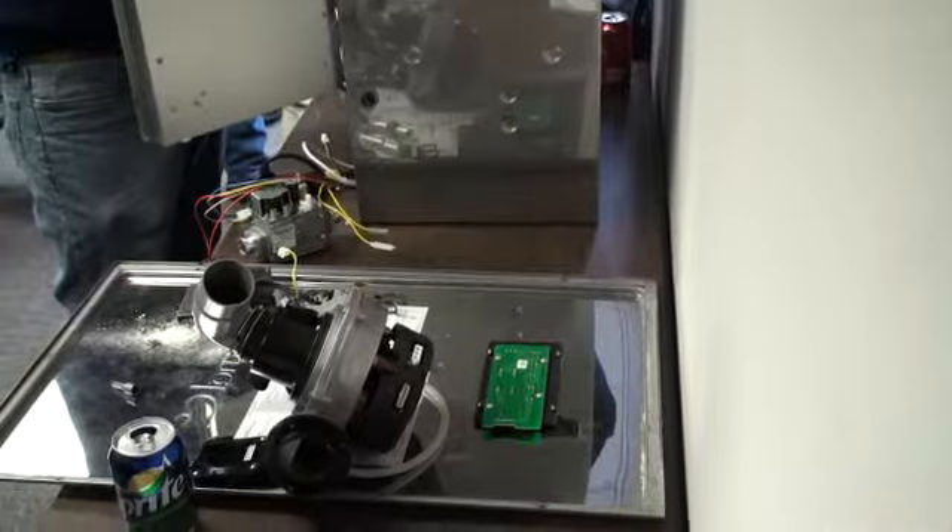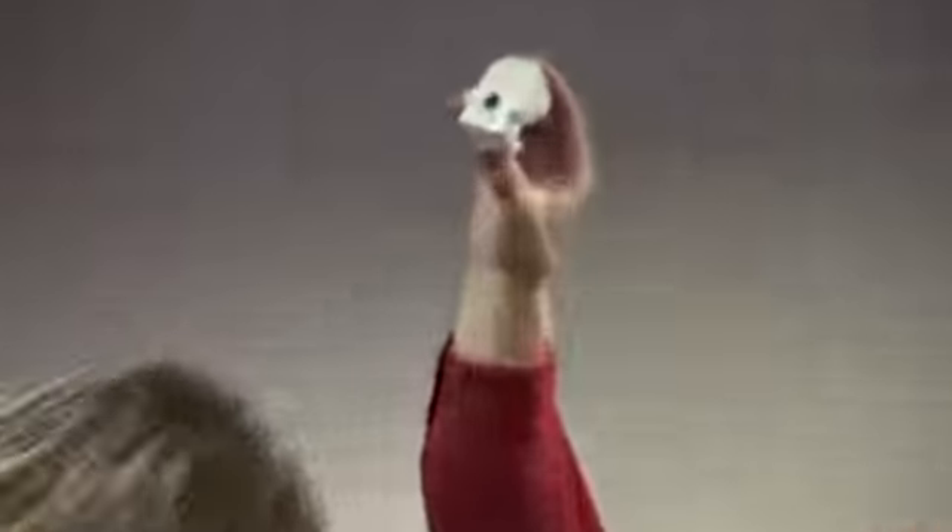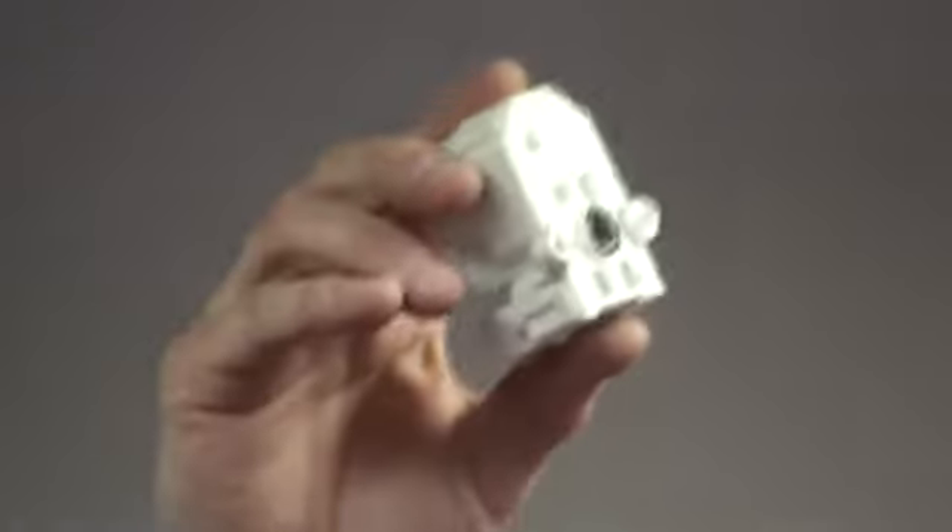When you pull the head off there, this one's in good shape because if you look at the threads on that cog, there's no black grease. If you pull yours off and you see black grease on the head compared to one that's all white, that means that valve's been compromised. There's a seal with an O-ring that uses the grease - when it pops the seal, the grease comes out, and eventually it seizes up.